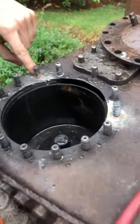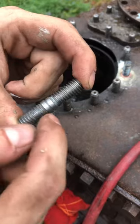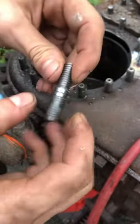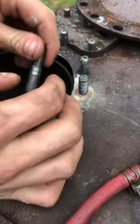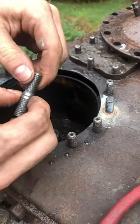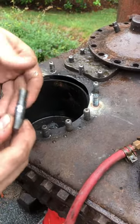To further explain — if you zoom in there — we drove them flat. There's a countersink in the boiler sheet, but not just that. These new studs that Bill made, I specified this internal groove. This is not part of the threads — you see it's after where the threads end. This goes down to the level of that countersink, so when we hammered that in with that mandrel, the copper not only squished outwards into a disc, but also into this groove in the stud. That's where the steam seal comes, and it's also part of the structure that prevents the boiler sheet from pushing up from the pressure. So this is not only a cylinder stud, but it's also a stay bolt.